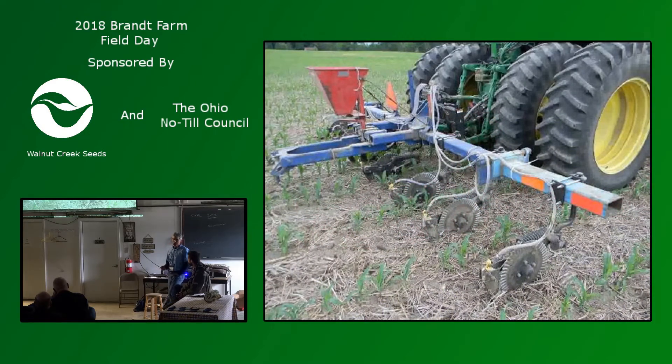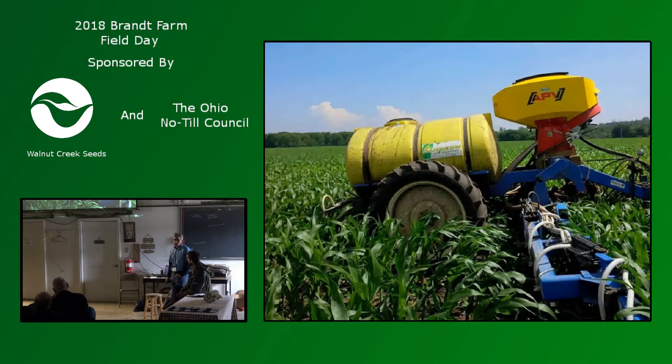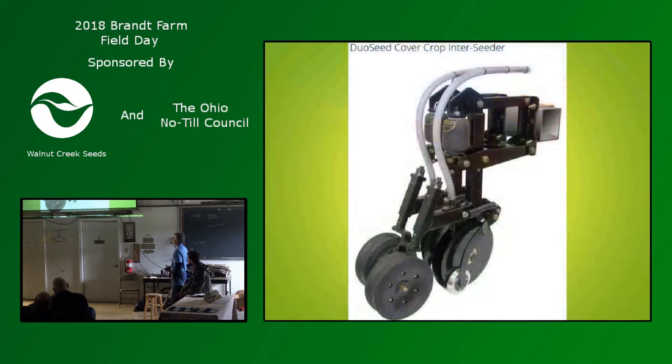Using old tools to do a new job — a little broadcast spinner that just kicks it out as wide as the side-dress toolbar. Here's a little more advanced tool to do the same job. That's one of the first generations of the DAWN duo seed unit, and here's one of their most recent ones. You can build a toolbar to do whatever you want — seed cover crops or build your own grain drill out of it. They say you can apply dry fertilizer through it as well, though you may need to buy a seed tube a little more often.